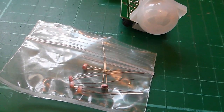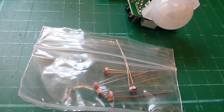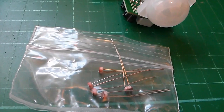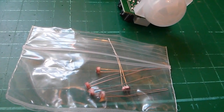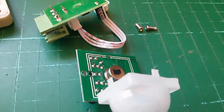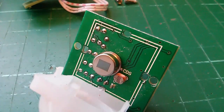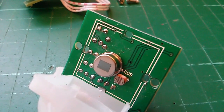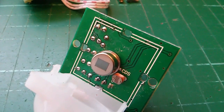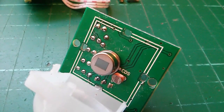I've found the light dependent resistors — here they are. You can get these in different flavours in terms of light resistance and dark resistance — you can get different values. I didn't do any research into these; I just bought the cheapest ones I could see. I don't really know what resistance this thing is going to require, but I'm pretty hopeful it'll just work. So let's get one soldered in. That fits rather well actually — the spacing of the solder pads is perfect. I haven't soldered it in yet, but there's the light sensor right next to the PIR. Let's solder it in and hope it works.